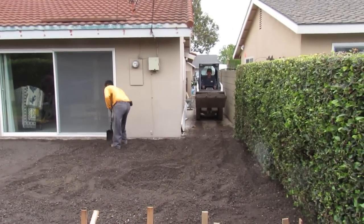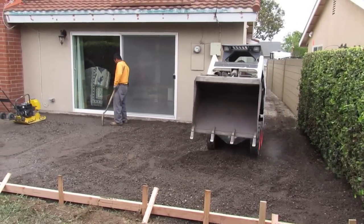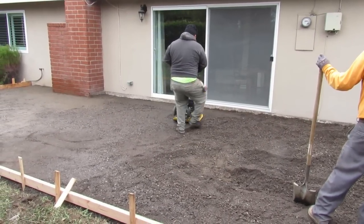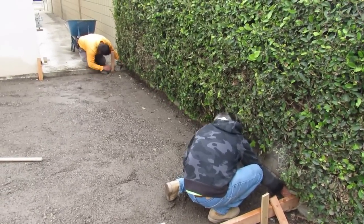Normally the soil's so good out here, you can compact it without a vibroplate with the tractor. Just fill the bucket with dirt and lift it about 3/4 high, and the way you spin and turn on it, you can get it tight as heck. But when you bring this much road base and you got 3 or 4 inches in there, it has to be vibroplated.